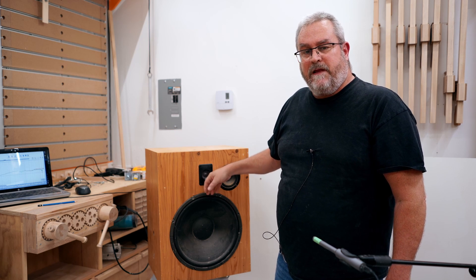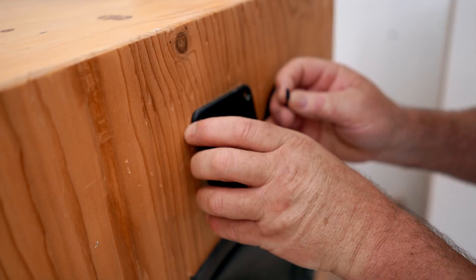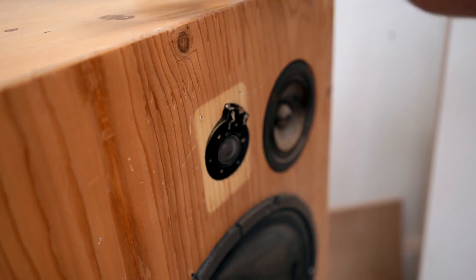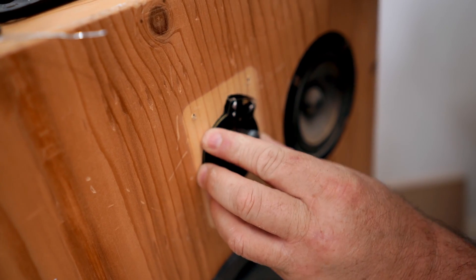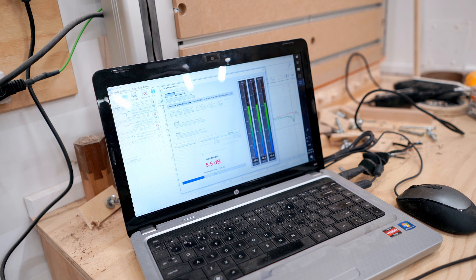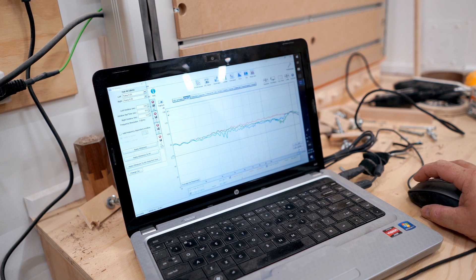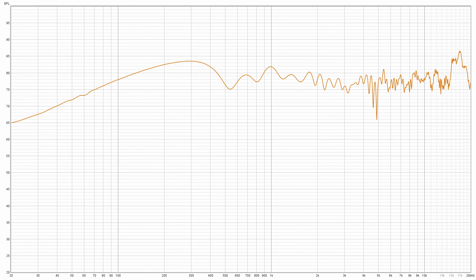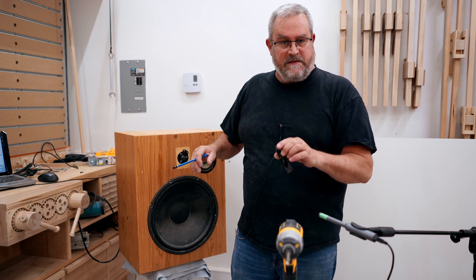Now the other thing I can do here is take the front off of this tweeter so that it's not horn-loaded anymore and measure it again. Oh no — oh shoot. I never took the faceplate off this before, and I certainly didn't expect that the lead wires going into the voice coil would be glued to the back of it. They were probably glued to the front and then they put this on and it stuck. So when I pulled it off I broke the wires, but I was able to repair them and run the sweep again.